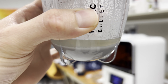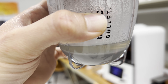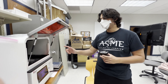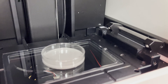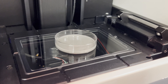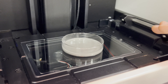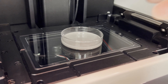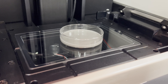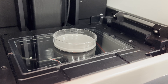The resin separated from the powder — you can see it settled on the bottom of the bottle, so we have to remix it before we use it. That's because it doesn't have a dispersant right now. The material is mixed and blended, but I just put a little bit in this piece of glassware. Normally you should use a wider one — I just don't have one in the room right now. You want to make sure the bed isn't actually mounted — there's no vat film, it's just straight glass. Before you put one of these in with the material, be absolutely certain none of it is dripping over the side and you're not going to get any on the screen.